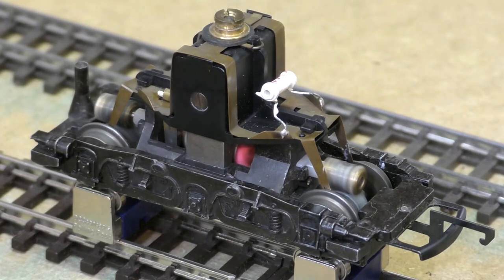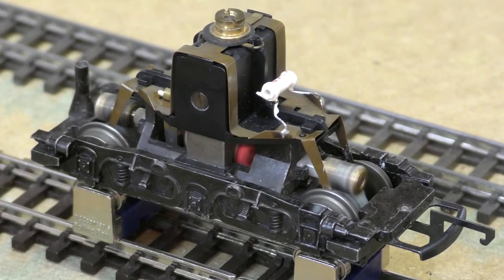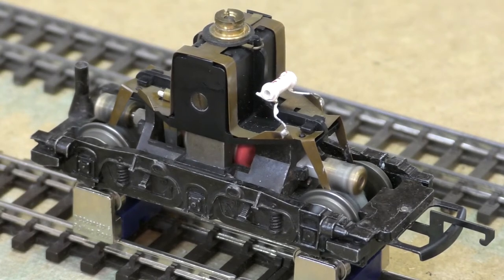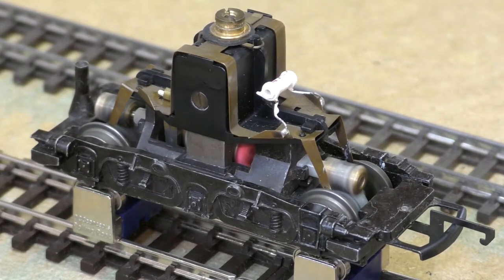There's only one thing you can do really — you've got to undo the wires. Now because it's five-pole, I thought I'm going to take a reference point at the top. I looked round the armature and found that one segment lined up exactly with one of the cores, so I took that as my reference. I thought I'm just going to rotate 90 degrees. The wires aren't long enough just to unsolder them and move them round, and when you rotate 90 degrees the commutator segments aren't exactly in the right place for my 90-degree start. So I took the bull by the horns, unsoldered the wires, marked them, and then very carefully gripped the commutator and rotated it about 10 to 15 degrees to line up my first initial segment.